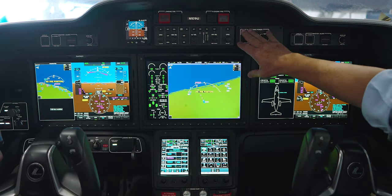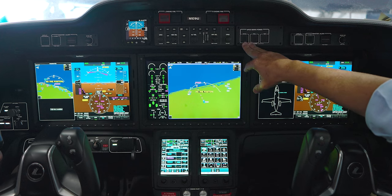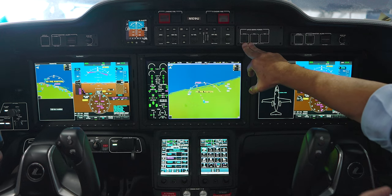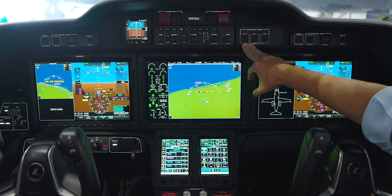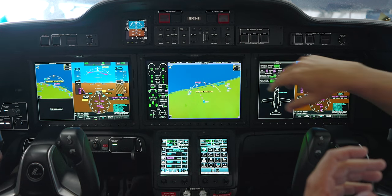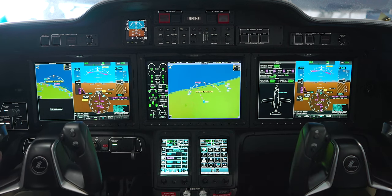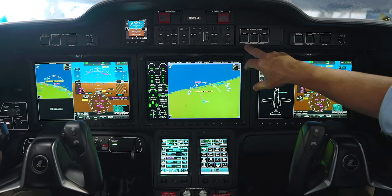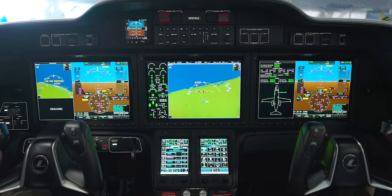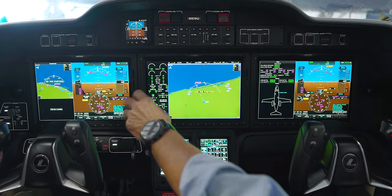Flight Level Change is probably one of my favorite features on the entire autopilot system. These servo switches — if for example you had a pitch trim runaway, you can shut it off here. On some other aircraft you'd be buried in circuit breakers at a critical time. Honda's put it right here where it's very easy and accessible. If you lose a primary EICAS screen, push display reversion and everything goes to the center screen and vice versa.